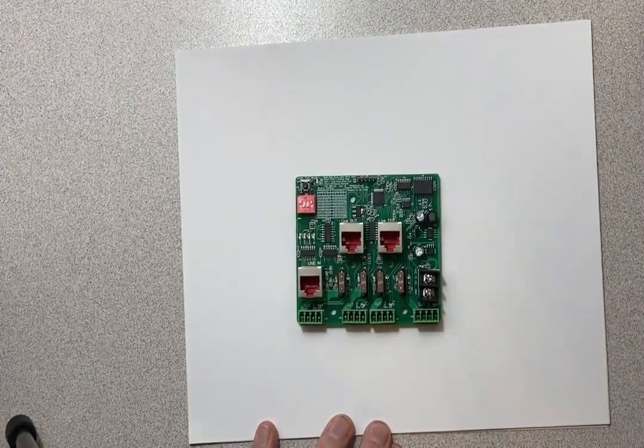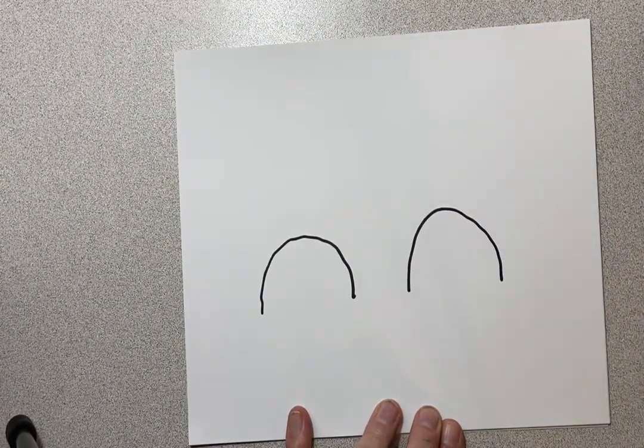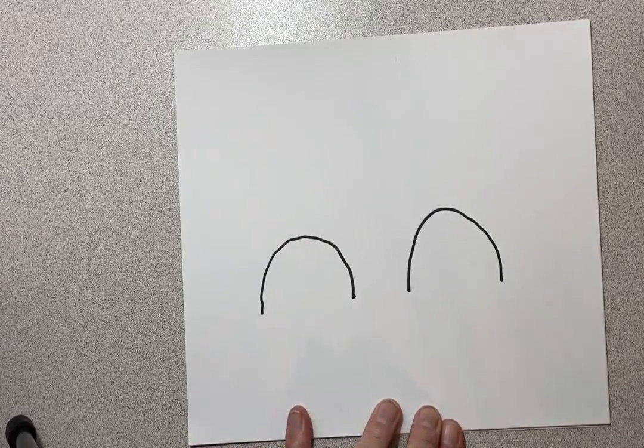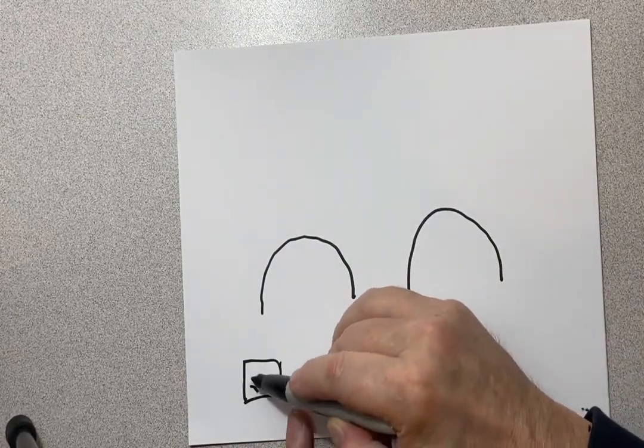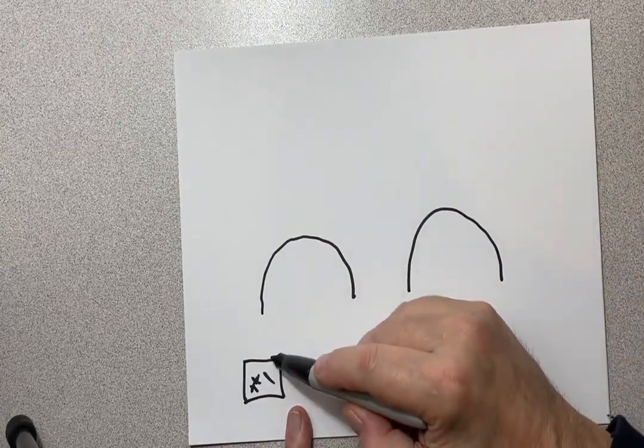Now, lastly, I just want to share an implementation trick. Let's say you're using long-range receivers, and in your display you want leaping arches. Typically, if you want leaping arches, you can program them separately. Let's say for this discussion you want 2 arches to behave always exactly the same. Instead of having a separate data stream for arch 1 and arch 2, you might have this one driven by smart receiver number 1 and this one driven by smart receiver number 5. They're both connected to port 1.